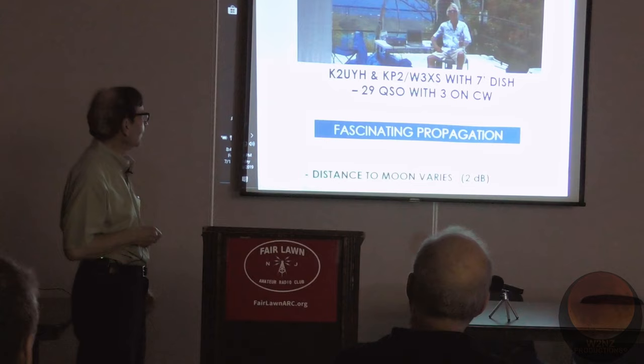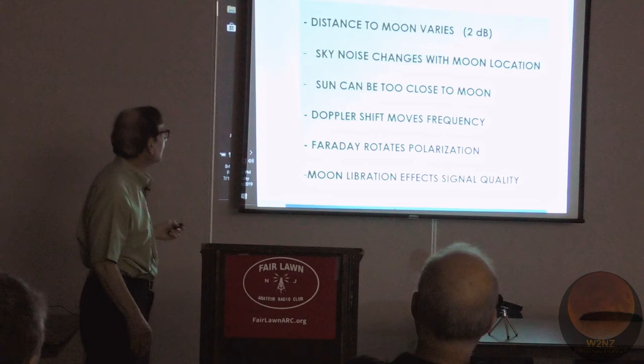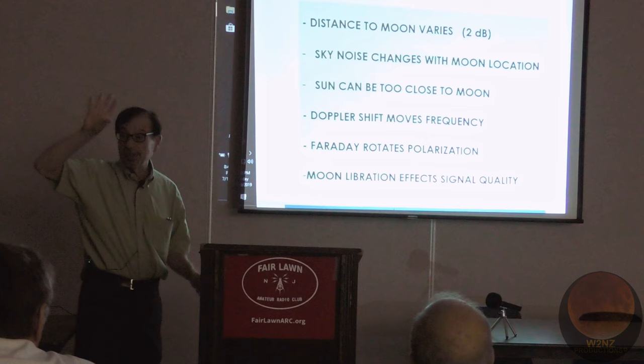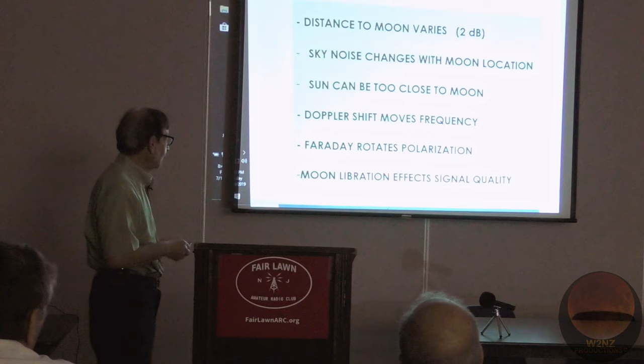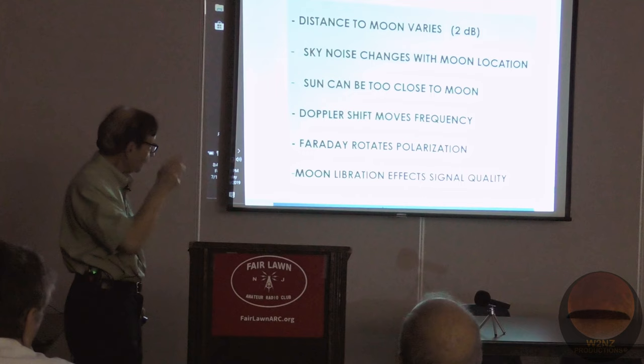So to wrap this thing up, Moonbounce is a fascinating propagation. There are a lot of factors that make it less than a sure thing. It changes with position, and the noise background behind the moon changes. These make it interesting enough that you're not certain you're going to make a QSO all the time. The sun can be close to the moon. The Doppler shift moves the frequency. There's Faraday polarization. And there are librations, which I am not going into, but the moon rocks all the time relative to the Earth, which gives you a modulation on the signals that tends to get worse as you go up in frequency. All these things affect whether you're going to have a QSO or not.